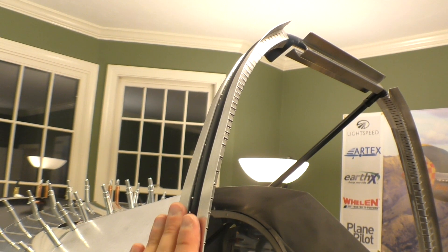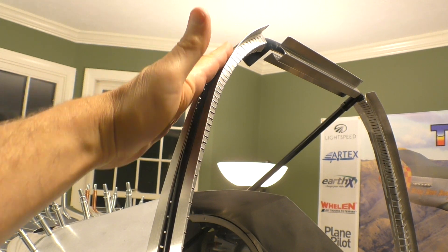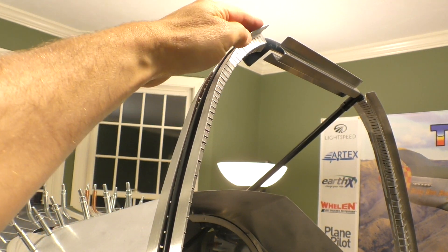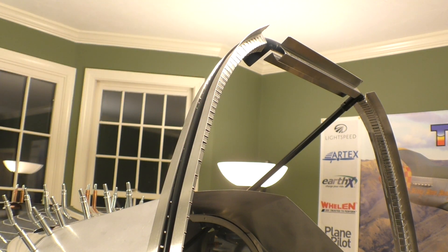From the back side, you can actually see that it comes up here and then twists. The reason it's able to make that twist is because we shrunk this side and made it tighter, and we stretched this ear and made it bigger — and that's how it fits. I got these tools from Eastwood and they're very inexpensive.